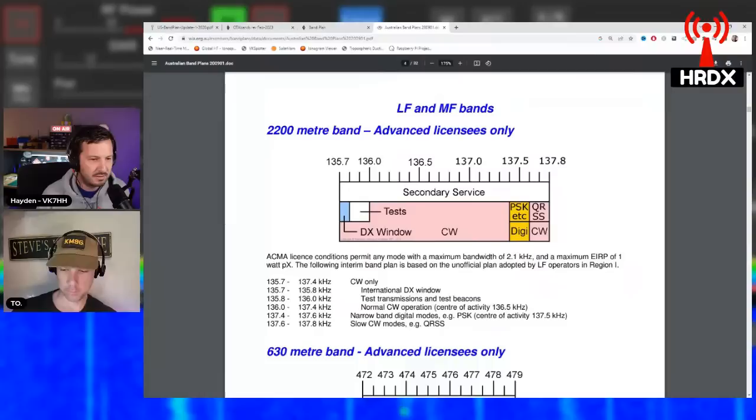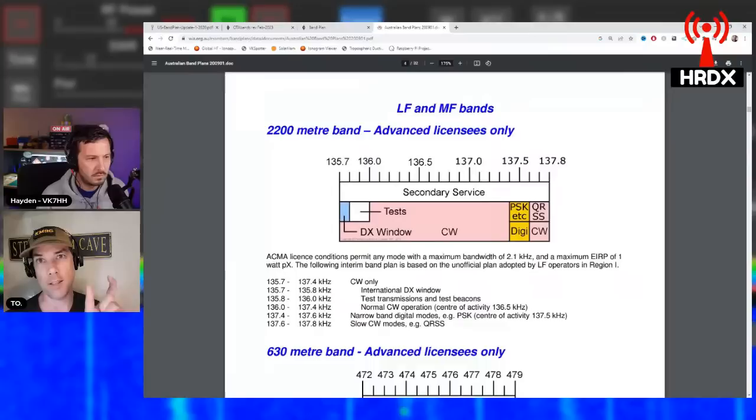Well, you say they're similar and they are relatively similar. However, there's some really interesting stuff. If you're trying to work DX from, let's say, the US to Norway, Norway's band plan doesn't 100% overlap the US general portion of the band plan. So you might be calling a frequency trying to reach a DX station and they're not allowed to respond to you. So if you're trying to work DX specifically, then be aware that the people you're trying to hear from need to be able to talk to you. It needs to be legal in their country to talk back to you.